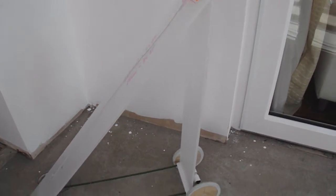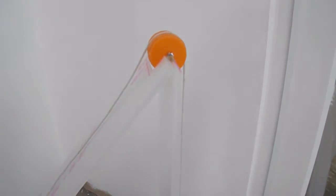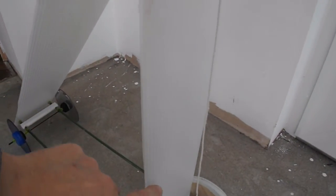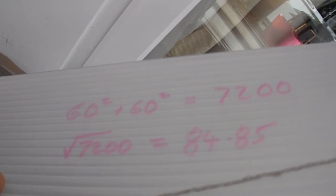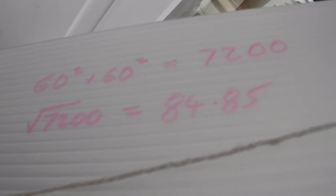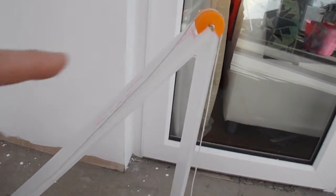There's our slope. There's the weight on some wheels. For consistency, I've used the same pulley on the back. The height of this piece is the same height that the tower was, which is 60cm, and then the pulley sits on top. I've done the maths: 60 squared plus 60 squared is 7200, and the square root of 7200 is 84.85cm. I've actually made this slightly longer than that because I've allowed it to go down near to the ground, but I think we'll find that is a 45 degree angle.